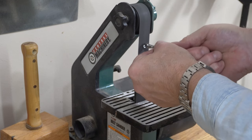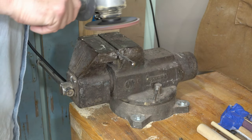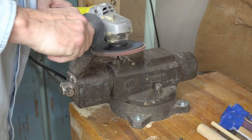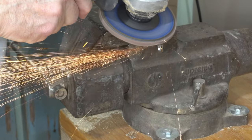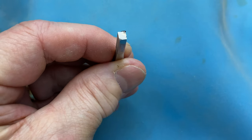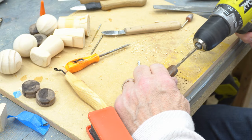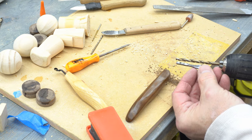With the rounded edges in pretty nice shape, I needed to grind down the handle of the wrench, taking it from a wider oval shaped handle down to something closer to a square shape so that I could fit it inside a drilled hole. Using the rough grit grinding wheel, it didn't take long to reshape that handle. Finally, I trimmed the tool shaft length with a cutting wheel, making sure to leave enough length on the shaft to securely insert into the walnut handle. Checking the shaft diameter against a few of my drill bits, I found a drill bit size that was big enough to hold the shaft but would still be snug.